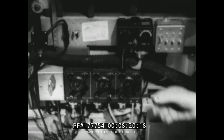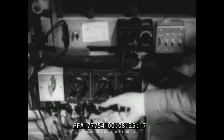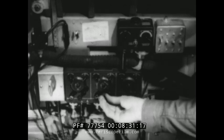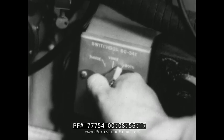It's a pretty easy test, Jones. Now switch back to the number one transmitter. To test the range filter, tune the low-frequency receiver to a radio range station that's broadcasting both voice and code, and operate the filter switch. On range, you should hear only code. On voice, you'll get only voice. And on both, you'll hear code and voice together. Finally, make sure the spring stops hold the switch securely in each position.